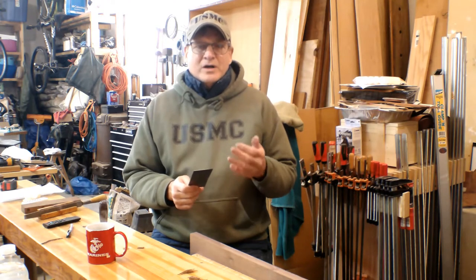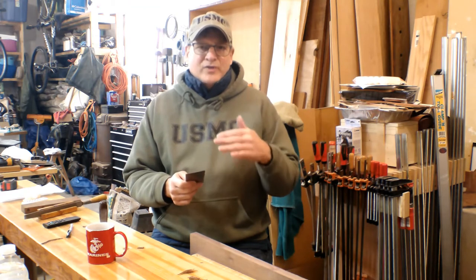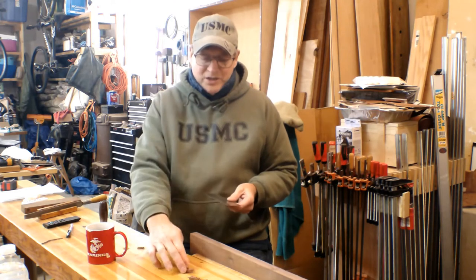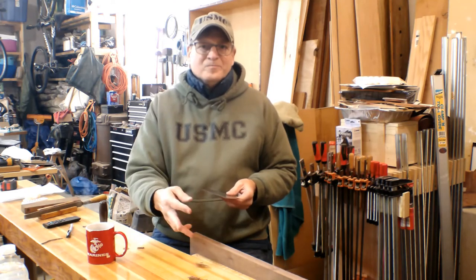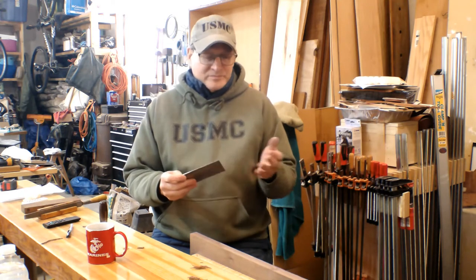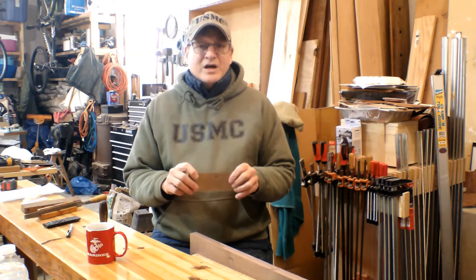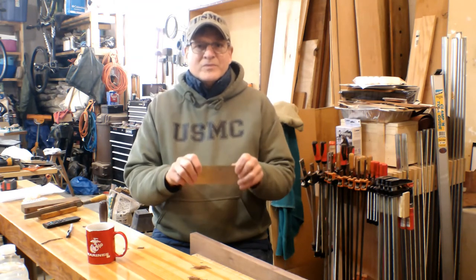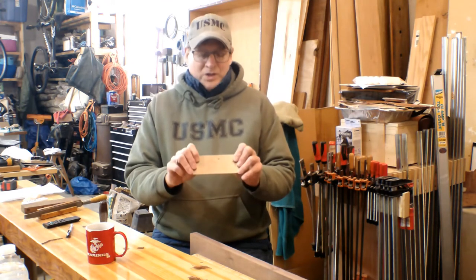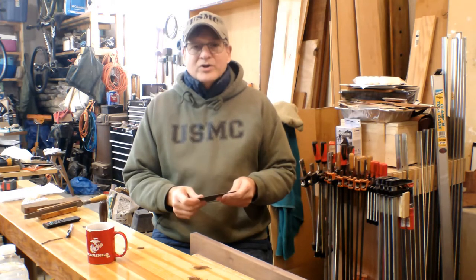It's great for popping off glue beads whenever you butt-joint two pieces of wood together, and great for flattening out squirrelly grain if you have little chip-outs. These are about 2 to 3 thousandths thick, so you can do the math as far as how many times you have to hit it. This will dish a piece of wood pretty fast. The downside is that if you're not accustomed to using it, you do need some hand strength — your wrist may get tired. But use it a little bit and you'll be good to go.